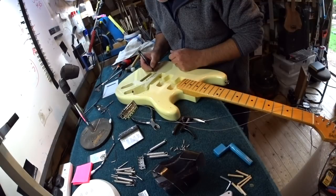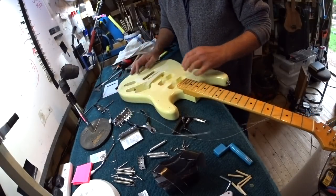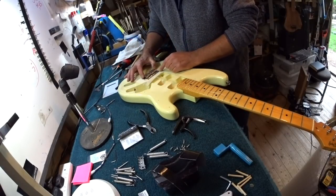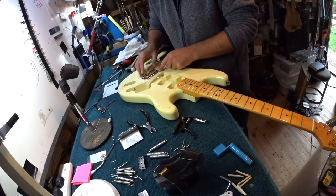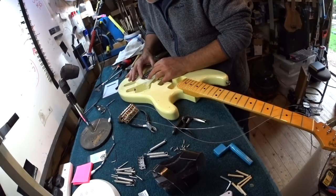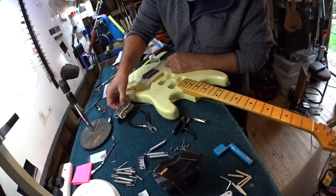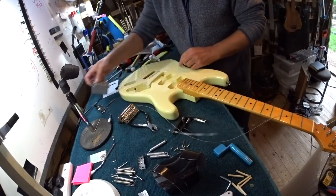Done by eye. There's my start point, and then we can then drill guide holes. Now that's all I'm saying is that is a slightly different position, there's a little bit of room for intonation still there. But let's just double check it against the original intonation, which we had there, there and there, and furthest back was there. Okay, quite a way back anyway. It isn't that much further back. Yeah, okay, overall. Yep, okay. So there you go. So that's our new position.